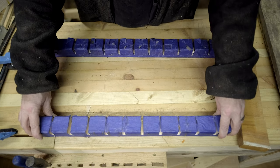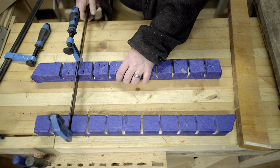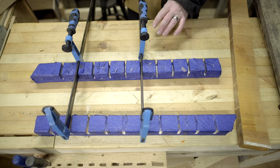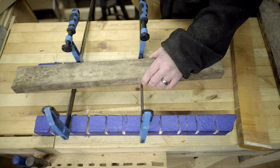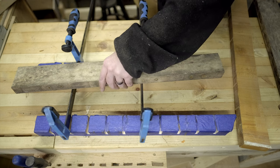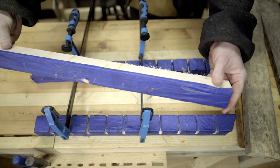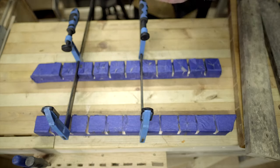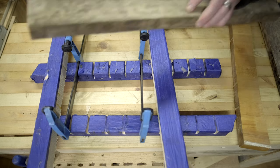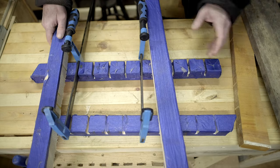I'll pop one piece right there and show you how I make these bits of wood reasonably accurately without any maths in a moment. I'm going to pop that clamp in there, and that clamp in there. Now obviously if I were to put in the wood to clamp up at this moment, these sections are still too high to touch the wood, so we then need some other bits of wood — I've put tape on them so the glue doesn't stick — and we pop those on there.